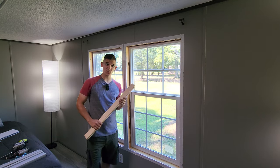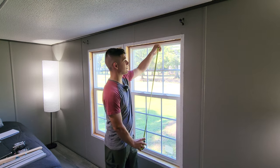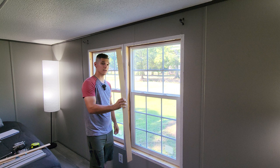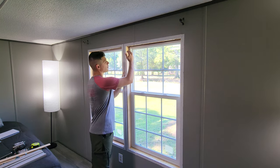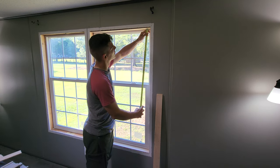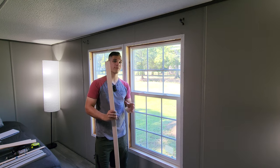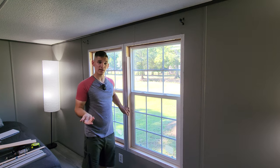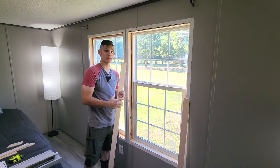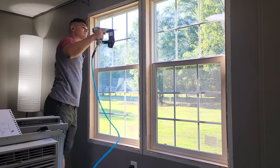We have the top and bottom piece for each window cut, and that's pretty straightforward, but I wanted to point out some things that can really throw off your measurements. If you try to take a tape measure from top to bottom of this windowsill, you won't get an accurate measurement due to the wood shims. This is a 48-inch piece of wood and it doesn't cover the whole height of the window frame. The easiest way to handle this is to temporarily tack in the top and bottom pieces, measure the distance between them, and then subtract the length of your longest board — 48 inches in my case — to get the measurement of the small filler piece. Once you have all the flat pieces needed for the inside of the window frame, temporarily tack those in so you can make proper measurements for the interior trim pieces.